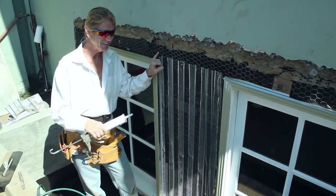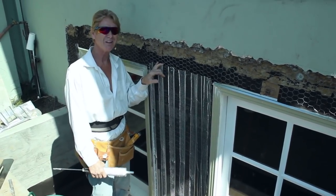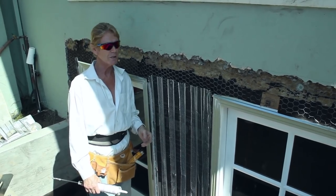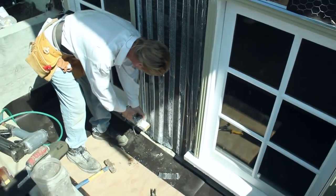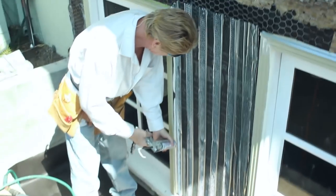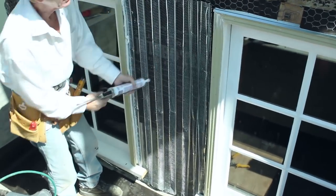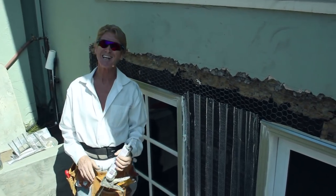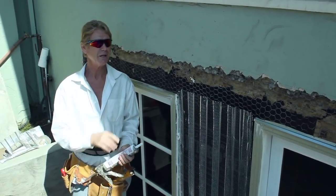Before I start plastering — caulking. What kind of caulking do you want to use on all of this? You want to use a polyurethane. Which ones are polyurethane? You've got Sikaflex 1A, you've got Moist Stop. As long as it says polyurethane, there are 50 brands of caulking you can use. Everything was caulked already, but after you put your paper, you just fuse that together. Get your caulking in there and make sure you've got a second bead — that way you're guaranteed no leaks even though it's already been caulked.